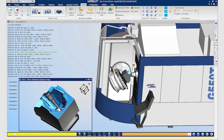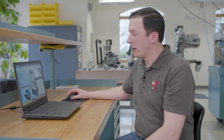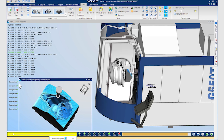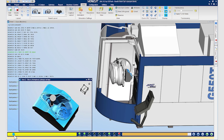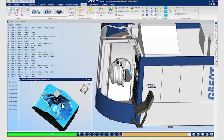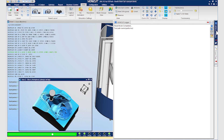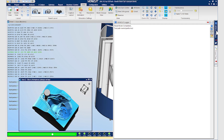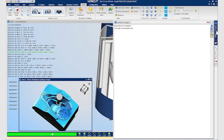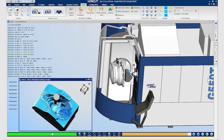On a part like this, we're working way down inside of a really deep pocket. You can see the length of this tool here, where one wrong move could mean catastrophe for this whole project. Here you can see I've slowed down the simulation — you can see the actual G-code flying by, and I can speed this up really fast just to get through the whole part. If there was a problem, we'd get a report that pops up saying there's been a collision, a shank-out, or something has happened between the part and the tool, or something inside your machine has collided. There may even be a line of code that doesn't have good syntax — all that stuff will be found in that report.